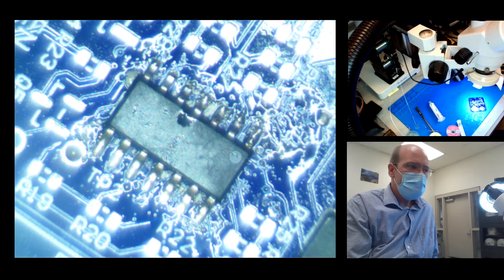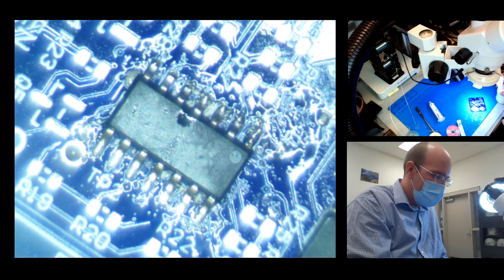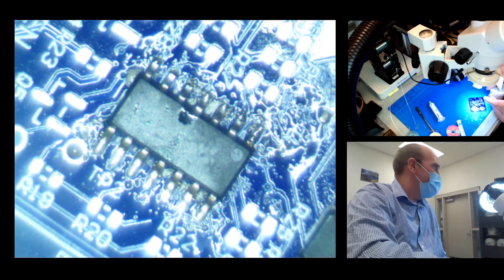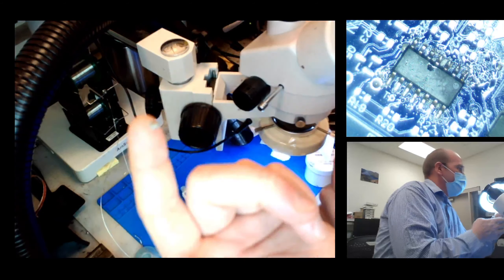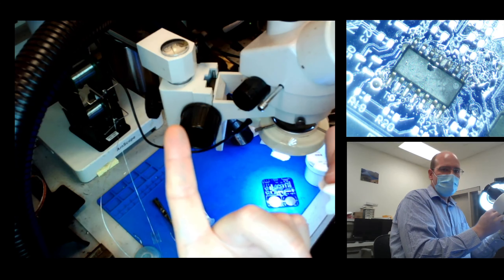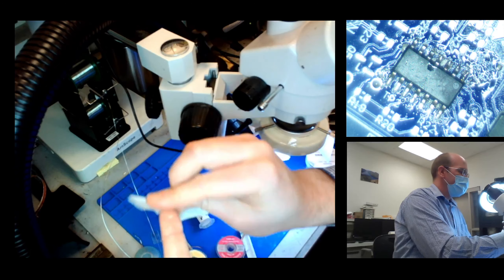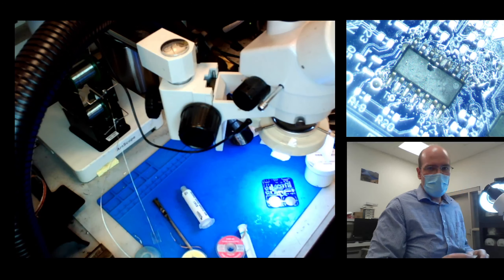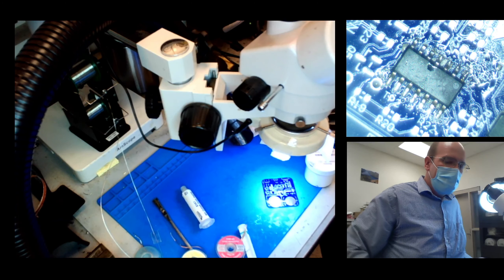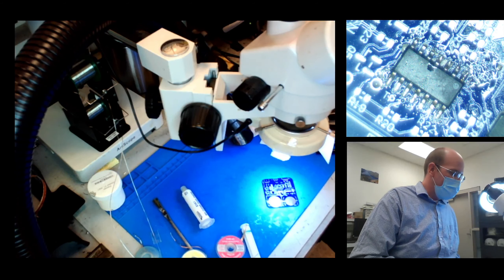You can do a clean Kim-wipe if you notice a smear of solder paste on your finger. If you try to wipe it off, it still leaves kind of a gray smear. But a little bit of alcohol rubbed around gets that totally cleaned off. If you can't get your hands really clean with just water and soap, put a little isopropyl alcohol on there — really any alcohol will do, even vodka, though it has water in it too.